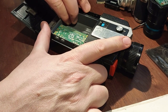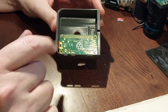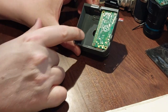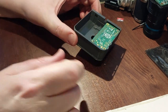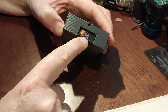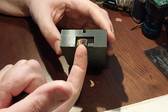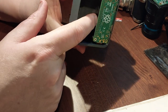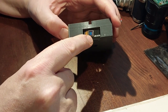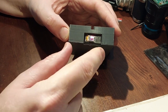This is actually in itself quite a challenge. I've put the Pi in there — the Pi just barely fits. I've produced a space for an 18650 cell, and I hope that 18650 cell will fit in there with the clips — I've left a bit of a hole for the clips. But the real problem is the camera module itself. This is the active part of one of those miniature cameras that you can buy on AliExpress or eBay. It's basically just the camera module and a flexible PCB, and you can see it curves around and goes to the Raspberry Pi. It comes with a little plastic spy lens on top, and the first thing I have to do is very carefully tease that off with a sharp knife, and I end up with this lens.